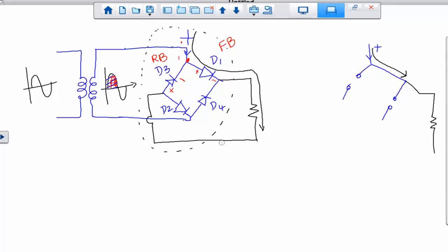This is also negative and positive, correct, to the source voltage. Again, opposite diodes are facing the same direction. So that means when D3 is reverse bias, D4 will be reverse bias, and so on and so forth. So this current at this point has to go through the resistor. It will travel through the resistor, and this resistor is effectively connected to somewhere here. Remember, this is positive current still, correct? The current is still positive.